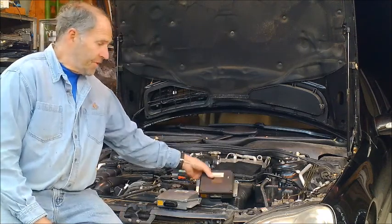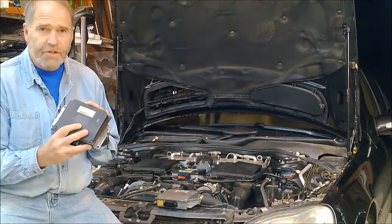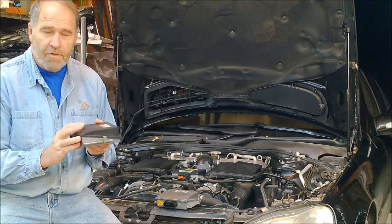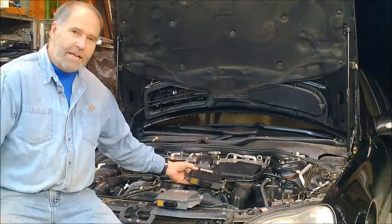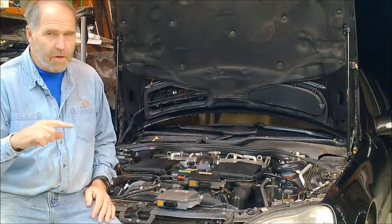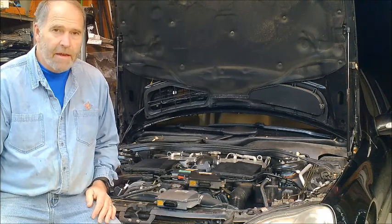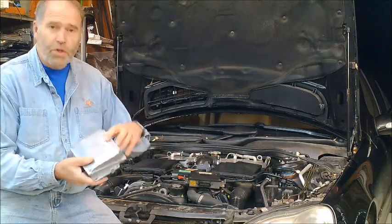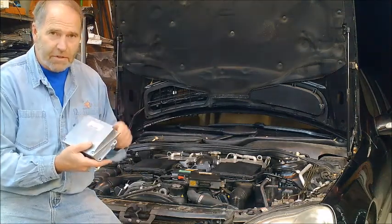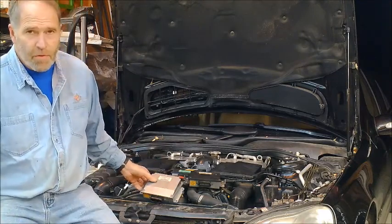Basically what you've got is a plastic cover. This cover was used late 99 through 2002, and in 2003 they kept it a black cover but the part number went from 0058 to 0158 for about a year. Then late 2003, 2004, they went to the metal cover and it became the 0258. We don't worry about the last two digits on the end - the Q1 - and basically these units are both functionally the same.